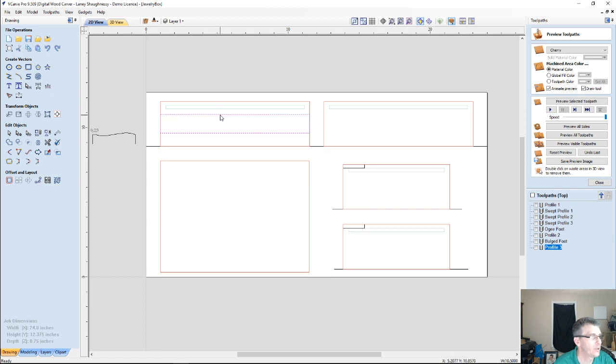And if I double click and put it in transform mode and I grab this middle box here, or one of the ends, it doesn't matter, the center on the end. If I hold down my control and alternate key and left click and pull over, it will restrict me to this axis, to this linear motion, whether I'm going horizontally or vertically. It restricts me to vertical or horizontal, for alignment purposes and all. So the alternate key does that.